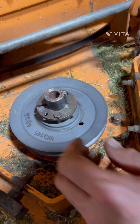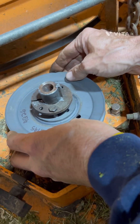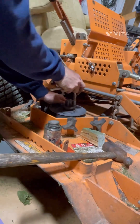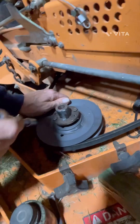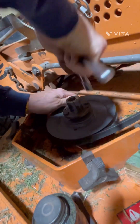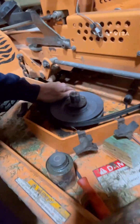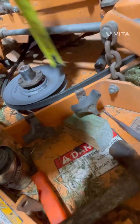We've got this one down here. Now we're ready to start tightening up the tapered collar that will tighten up the pulley on here. We're tightening our tapered collar up on our pulley, which will hold the pulley tight on the key on the shaft. You want to tighten each one of these bolts evenly — turn two or three turns on one and then two or three turns on the other. And while you're doing this, keep checking the distance of the pulley off of the deck.